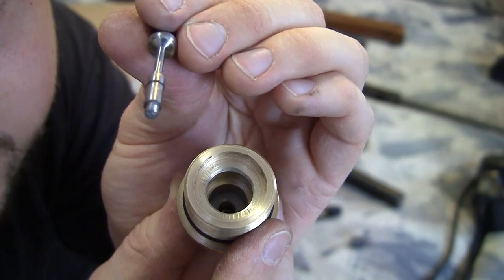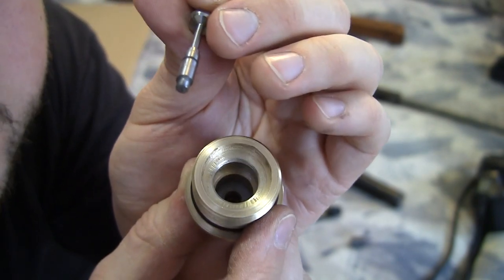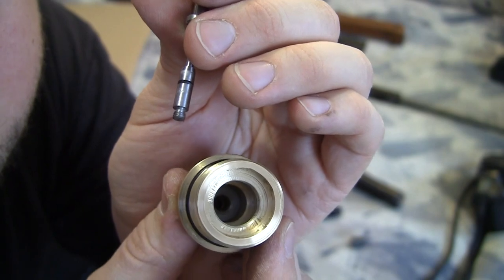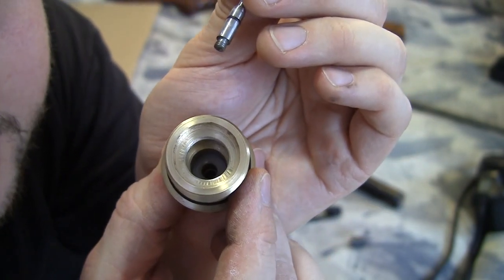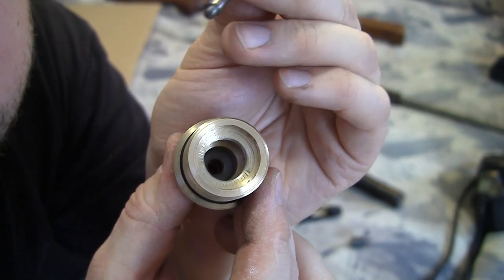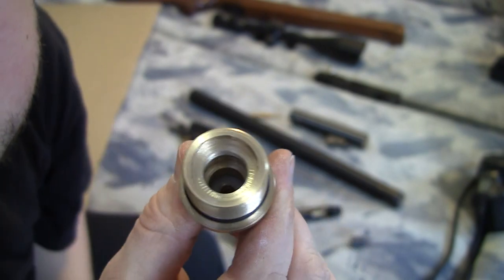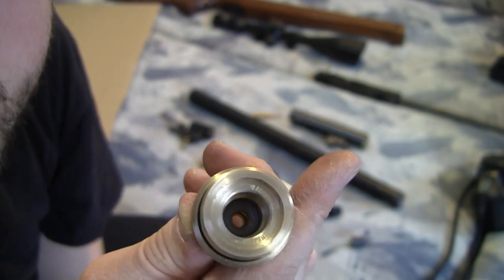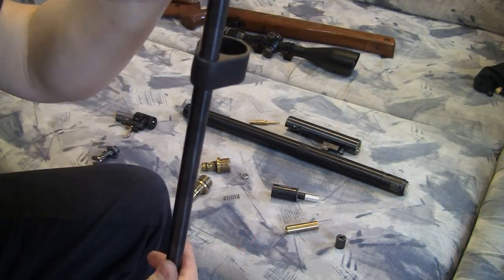And because the valve is easier to open, you can use a weaker hammer spring or just set it a little weaker, because you don't want the hammer to put too much stress on the gun when you shoot. So this is one more modification. It's not necessary, but it will improve especially velocities and also accuracy. I think that's it.